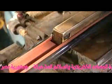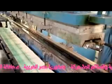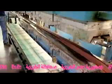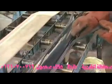10 to 15 minutes later, the mold lifts, and a chemical reaction called vulcanization has occurred. The layers have been laminated, and the handrail is now strong enough. The last step is to trim away the flash or excess material.